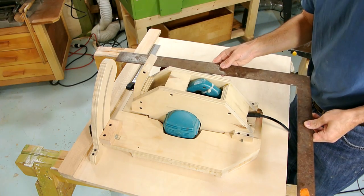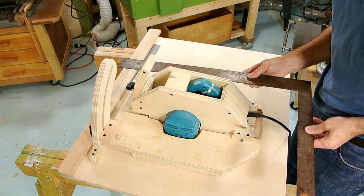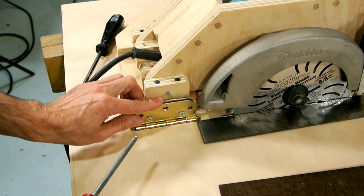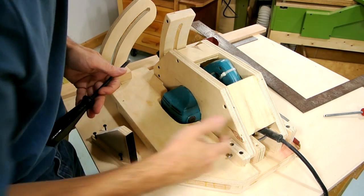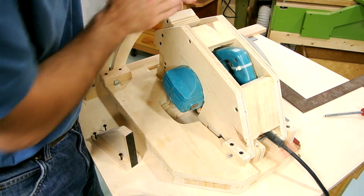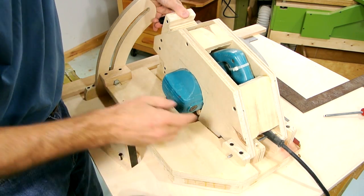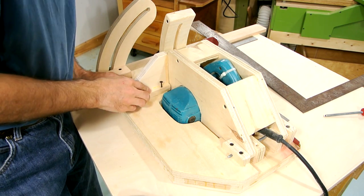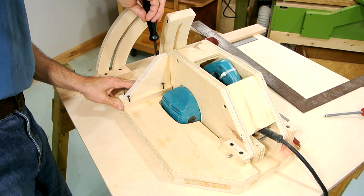There are so many things on this saw that could be crooked. I'm just using these squares to try to eyeball it. This tilting axis here is really critical for alignment and depth of cut adjustment. The problem is this isn't stiff enough — I should have made this bracket much wider to get more stiffness on this tilt. But I've had the idea of just adding a bracket that pushes against here a little bit, and that will help this part stay aligned as it tilts up and down.